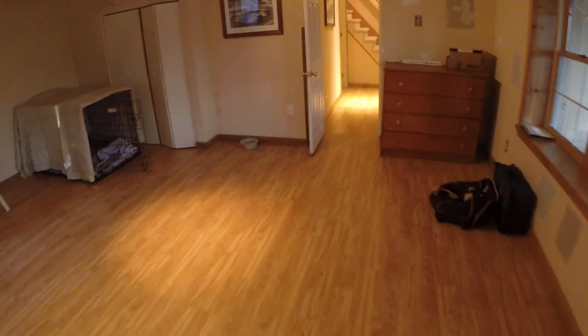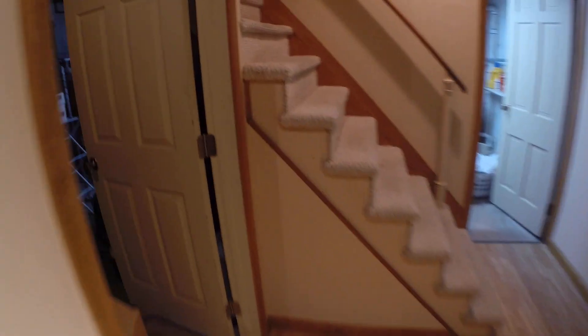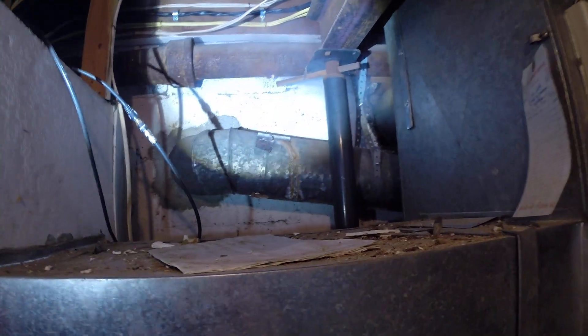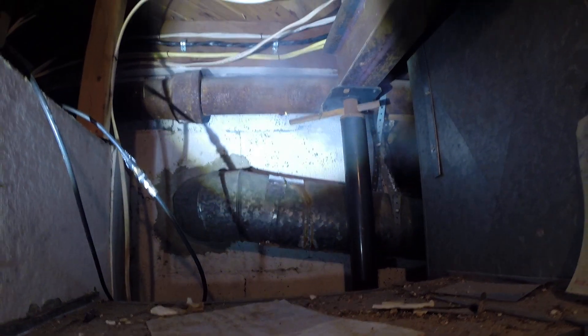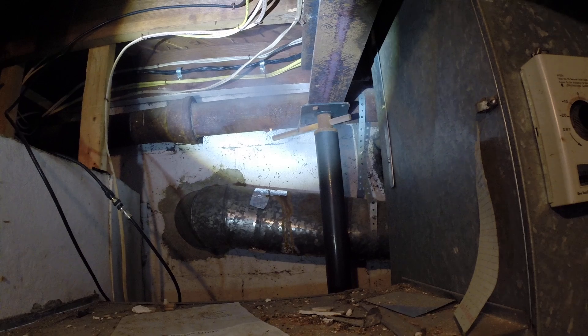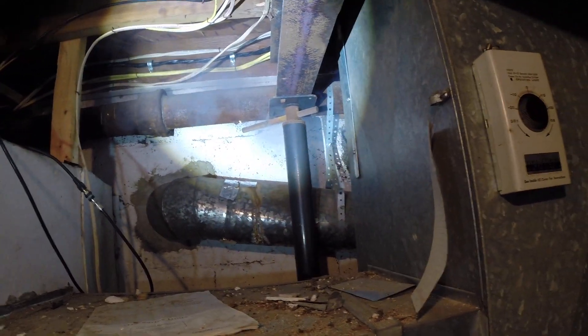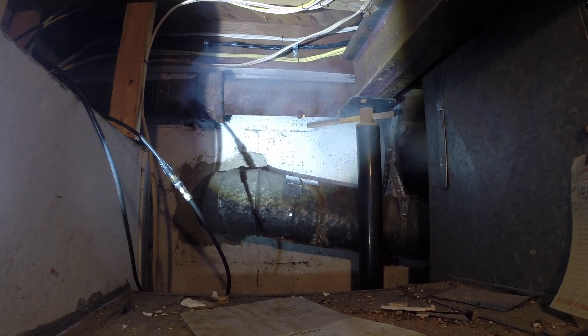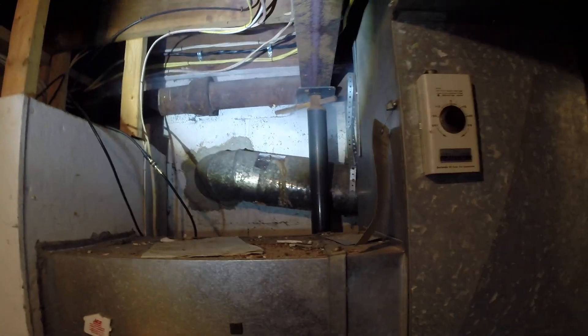The scent was down here, so we're looking for any trace of smoke. And sure enough, here we have it. Smoke is literally pouring out of that pipe right there — you can see the corrosion. And that is definitely our problem, which we had not found earlier. But clearly that's where the odor is coming from, so now we know what to fix.